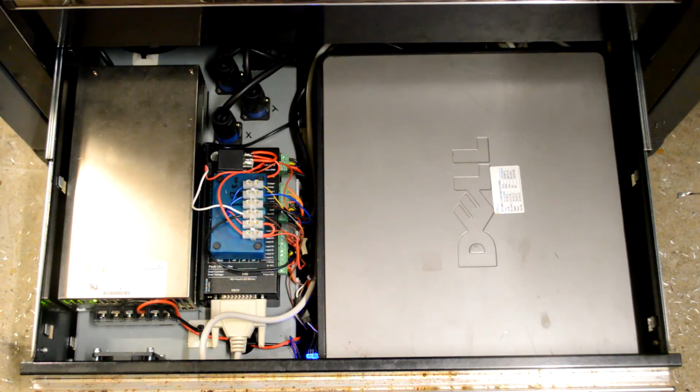Steppers are quiet, there's no resonance to it. The current limiting works really well. The steppers barely get hot when they're sitting at idle. I've left this thing on literally all day with no problems. It's got all 3 stepper drivers built into it, breakout board, everything on there really.